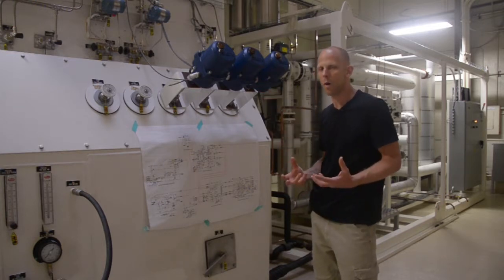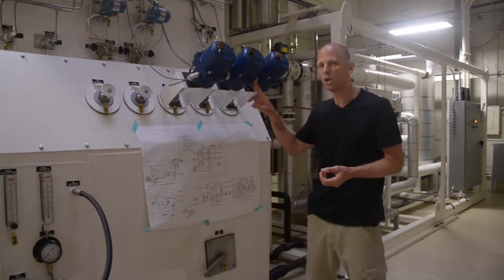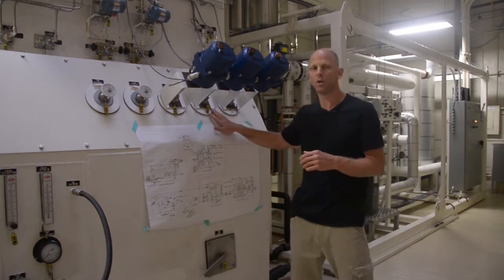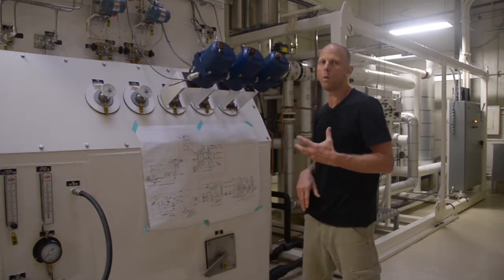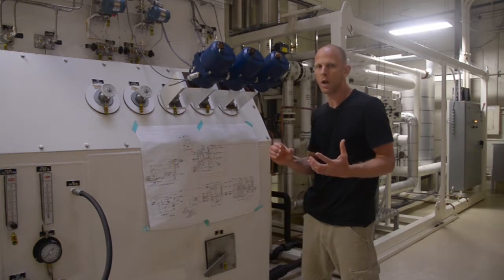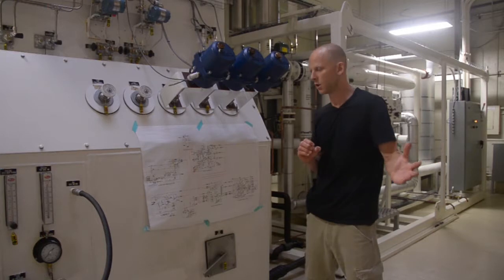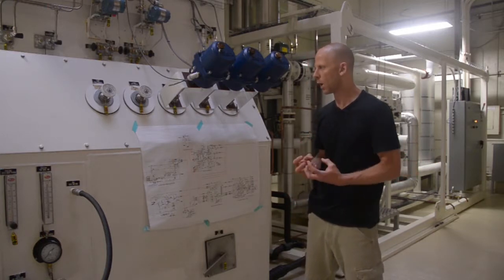If we find that we are producing very high purity product, we know that we can reduce our column pressure a little bit as we reduce pressure control valve 511. As we reduce our column pressure, what we're essentially doing, we're closing down the column, we're putting more gas flow through to the turbine loop. We will begin to make more liquid.